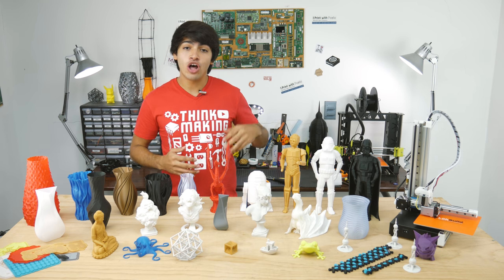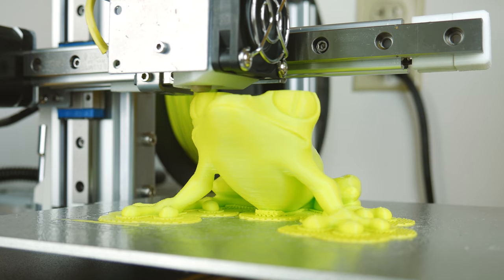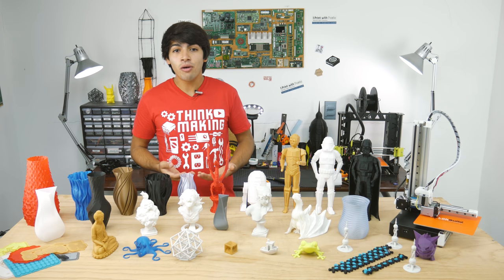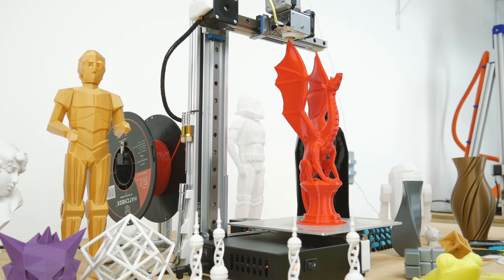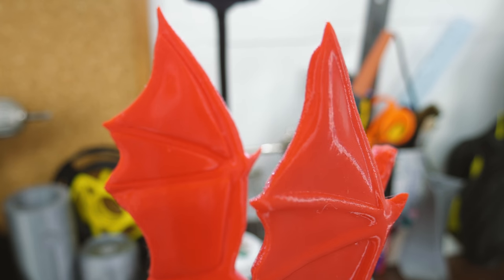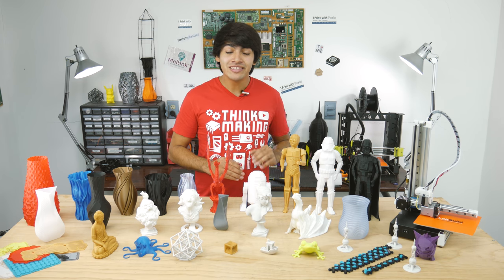Both the accelerations and decelerations, along with the print speed, are affected by the high, normal, and fine settings within the slicer. To see if there's a difference in print quality between the three settings, I printed the same model with each one, and I could barely tell the difference. Yet after quite some testing, I noticed that the fine setting would create smoother and more precise walls. I don't understand something though — if I try to move the Z-axis with my hand, I'm able to do it, and while printing a tall model, I can actually see the Z-axis vibrating. Yet for some strange reason, all this motion doesn't directly translate to the print. Take this dragon printed at 0.2mm layer height with fast quality, made as tall as the printer could handle — I could see the Z-axis moving, yet the model is perfectly smooth somehow. This is the same for other models like the Darth Vader or the Stormtrooper. I have no idea how this printer is able to keep models looking so nice even when tall and printed at high speeds, but whatever the reason is, I love it.